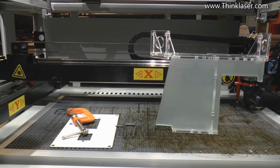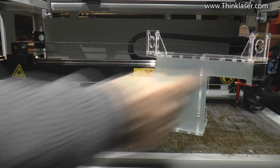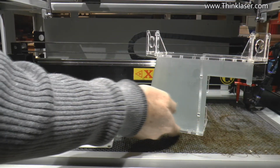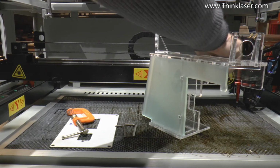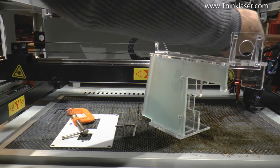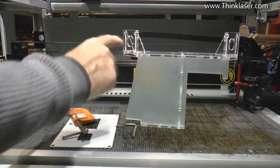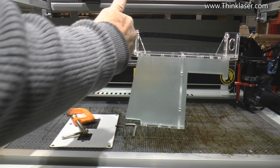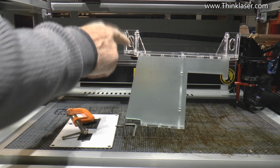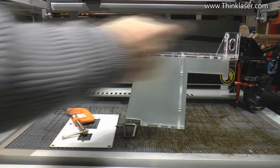I've already started to do some destruction, but let's just explain what we're trying to do. What we've got here, we've got 2 mirror reference points. Now these mirrors are set the correct height from the base to match the centre line of this mirror here. Not the centre line of the hole, but the calculated centre line of the mirror itself. And the front edge of these two holes has to be roughly where the mirror faces are, and they will tell us the correct position in space, 45 degrees each, and the correct height.